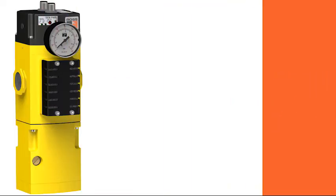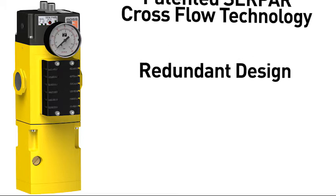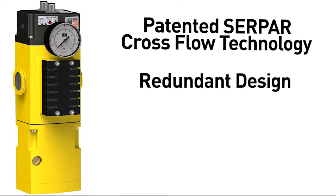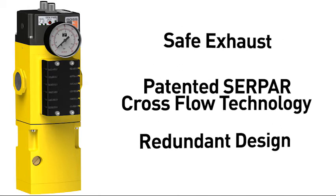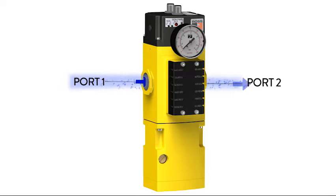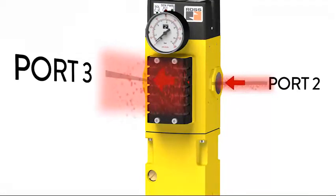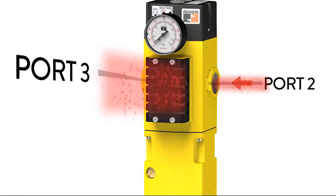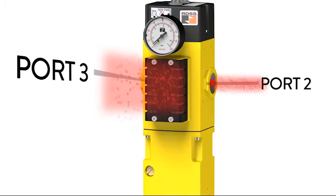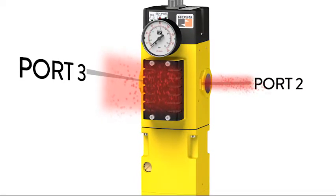The Ross Controls M35 safety exhaust valve features a redundant design with two valve elements that incorporate Ross's patented SIRPAR cross-flow technology, ensuring safe exhaust of pneumatic energy. When the valve is energized, air flows from the inlet at port 1 in series through the valve to port 2 to pressurize the machine. When an e-stop or other stop signal is provided, the valve shuts off supply of air and exhausts in parallel from port 2 to port 3. Parallel exhaust provides a rapid exhaust of downstream pneumatic energy in the machine. Because of the valve's exhaust flow capability, the air is rapidly exhausted, even in the event of a fault within the valve.